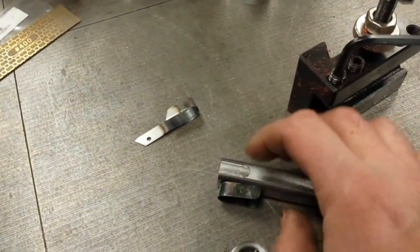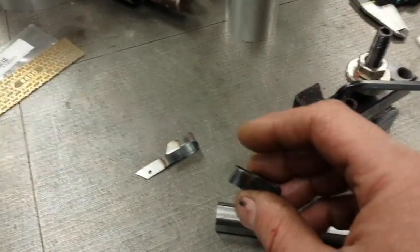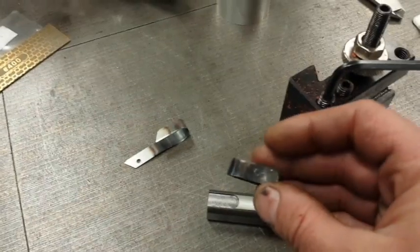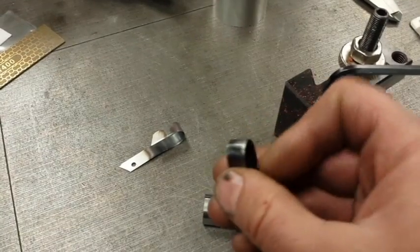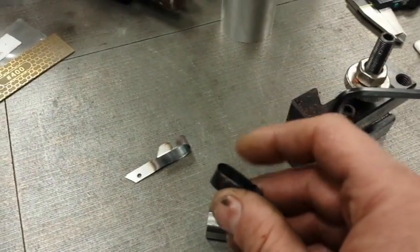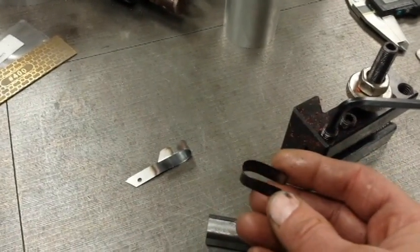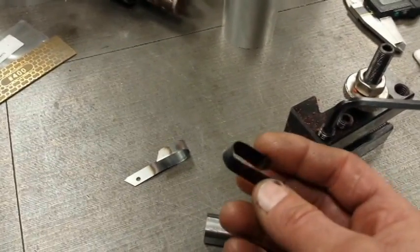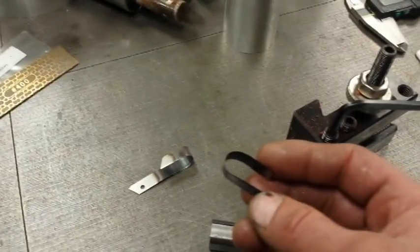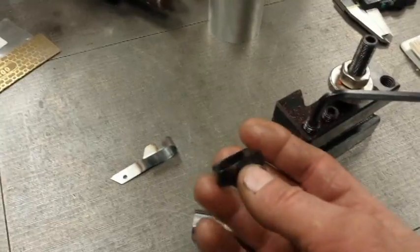By the way, the center height of the edge of the blade has to be lower — it's a negative rake. You have to excuse my English, by the way; I'm a true Frenchman. It's a negative rake, so you bring it around one eighth below center, and it just cuts beautifully. Keep your RPM pretty low — no more than 300 RPM — because you don't want centrifugal force pulling the rubber out and cutting more than you want. It has a tendency to pull on the rubber itself.